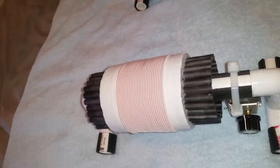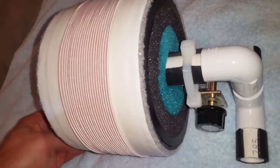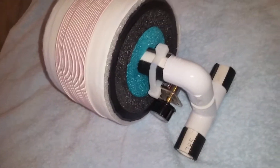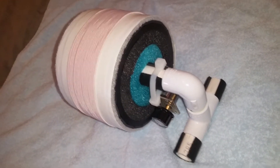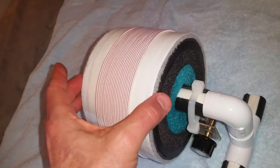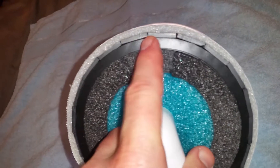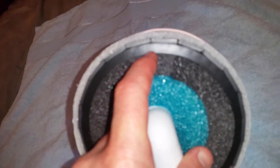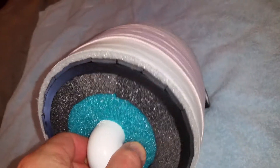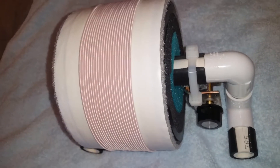This airport-friendly model was designed as a replacement for this 5-inch BAR FSL frequent flyer model. Although that model is extremely effective for DXing purposes and has been taken on Hawaii DXpeditions by both myself and Craig Barnes, the problem is that the 100-millimeter long ferrite bars in this model, arranged in a cylindrical pattern, are no longer available. In fact, they have not been available for four years.